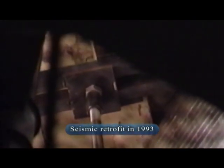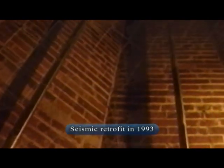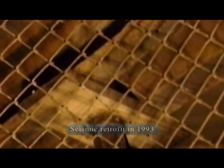During our seismic retrofit, we were able to remove the large diameter stainless steel bolts that we had installed after the Scotts Mills earthquake, replace those with a reinforced pneumatically placed concrete wall, tie the brick together with the marble, and then reattach the Oregon Pioneer to these reinforced concrete walls, something that originally had been omitted from the original 1937 drawings.